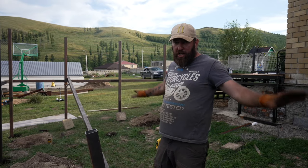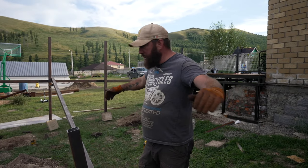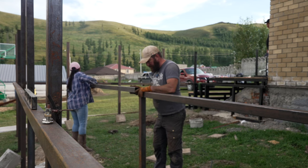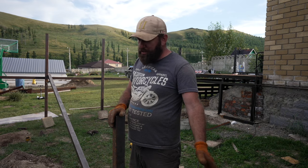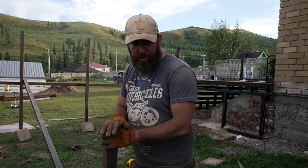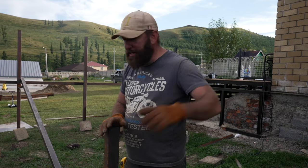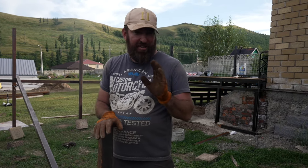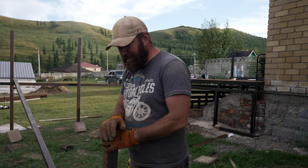Zule's arrived back with some more metal so we can get back to work. It took a lot of calculations to get it absolutely correct — now I need to sit down and calculate the floors, exactly how many we need. What we're working on now, since we've finished the outsides, is the cross beams — three cross beams from each of those poles. We're going to join two pieces together: one is about four and a half meters, the other about three meters, alternating as we go back. We'll put in the extra posts and add bracing on each side to hold it in place for welding before we pour the concrete.